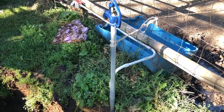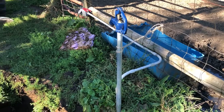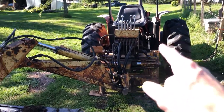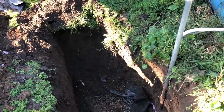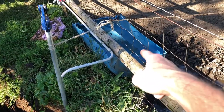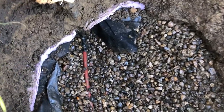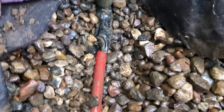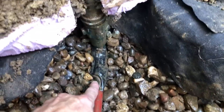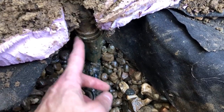I'm gonna share with you guys the issue in case you might have a similar situation. I used a tractor hooked up to a three-point hitch to help with this. It's kind of an emergency project — I need this hydrant to give water to my cows. There's the pipe: it's five-eighths PEX coming out of the house, and this is where it connects. I put some tape in here — this is where it drains, and this is where the problem is.